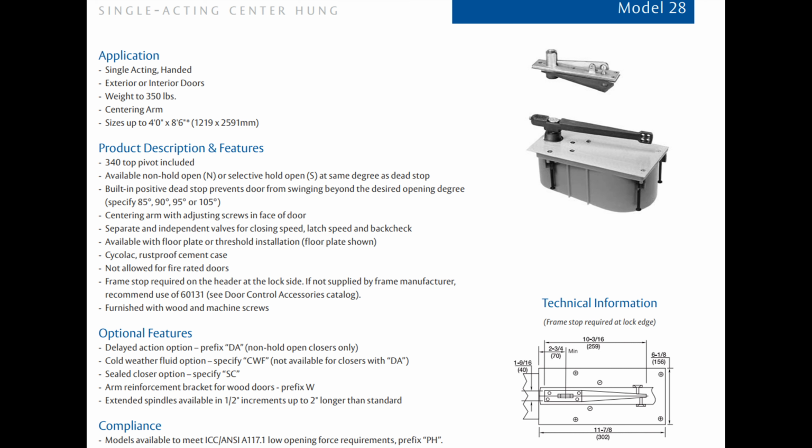And then the other thing with floor closers is, you're going to change the guy's part number, from a 20 to a 28. So your guiding light really should be: is the 28 rated for the same weight as a 20? And it is. It's actually a heavier closer. But is there anything about the 28 that would be problematic? Is there a wood door package for the 28? If it's wood doors, will he be able to install it to a wood door? So you'd want to look into issues like that. But I think what you do is you requote it as a standard 28.